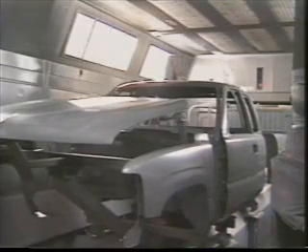Four robots apply the primer. The surface is then dried before painting. The plant is equipped with 10 paint spray modules. A barcode located on the front of the carrier tells the robot what color is to be applied and where to spray the paint. The robots pick up the proper amount of paint for the job and atomize it for application with water. General Motors uses waterborne paint, which is more environmentally friendly than others such as lacquer or enamel.